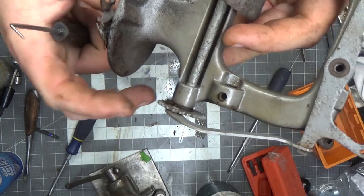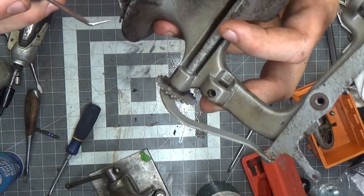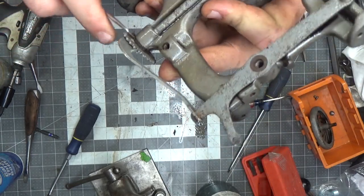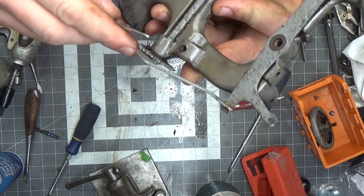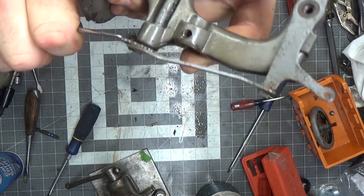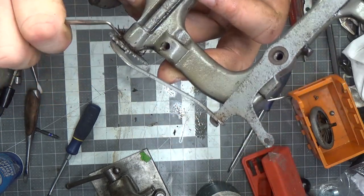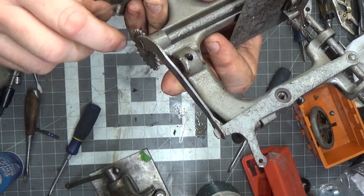All right, so this is sort of interesting here, because the sandblaster will not remove things that aren't rigid. It has to be very, very stiff or immovable. If it's greasy or whatever, it just will push it around. In this case, there just happens to be a bunch of string caught up here. And I wonder if this was probably the reason they parked this, because the string got so bound up into this mechanism here that this may have led to the downfall of this machine.